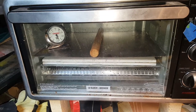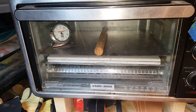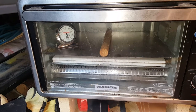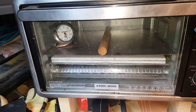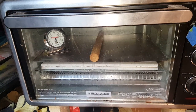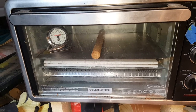What I do is heat up the oven and preheat it. Once the oven is heated and the ceramic plates are giving you nice constant heat throughout the oven, put the kydex in and let it sit for about 4 minutes. At 4 minutes it seems to have equalized in temperature across the kydex, and works very well when I put it in the kydex press.